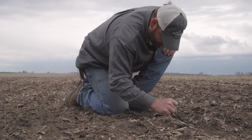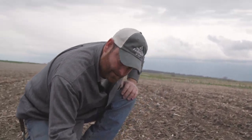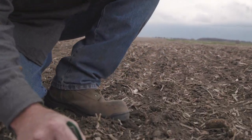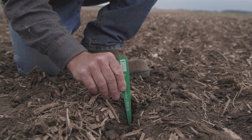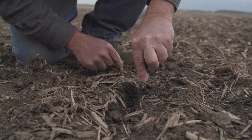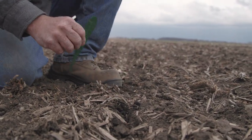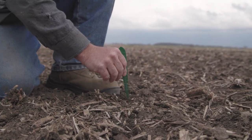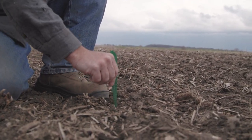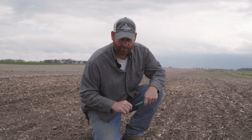I can see I'm getting really good closing. I don't have any gaps. And there's the oat at the bottom there, all nicely tucked in — right at about an inch and a quarter, like it's supposed to be. So now I know I'm set right for my depth. And if I wanted to, I could dig back about a foot and count how many individual oats are there. But since I've already calibrated this thing, and I've been running this drill for several years, I know how good it's running. We've got our set right.